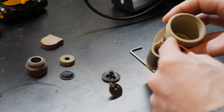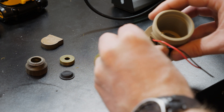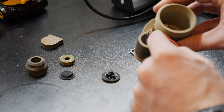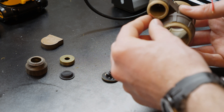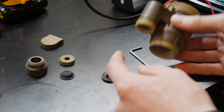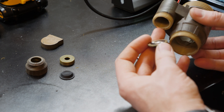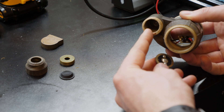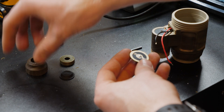Then you'll want to snip it right here. You can thread this over first because this connects to that little hole right there, and then snip it just so it's barely sticking out. You will then want to solder that. This contact basically acts as a wire from this part of the board to this other part of the board and it completes the circuit. This solid piece of wire interfaces with the ring around the battery cap.